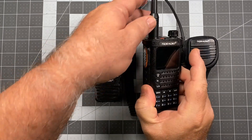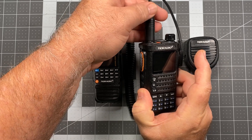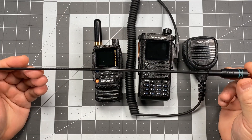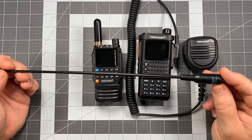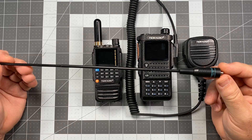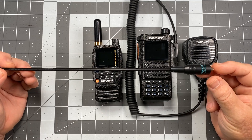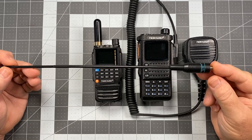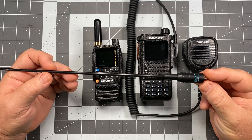The first one I want to take a look at is the TD771 whip antenna. This is a 14.9 inch long dual band antenna designed to work in the VHF/UHF spectrum. It works fantastic for VHF 2 meter, great for 70 centimeter UHF, and GMRS works pretty good there as well. So it's a very versatile antenna at a really low cost — I'll leave links in the description.